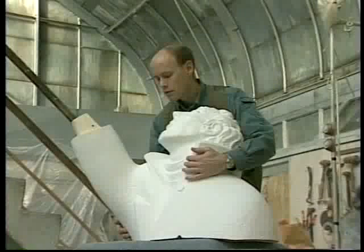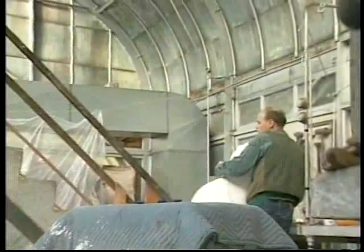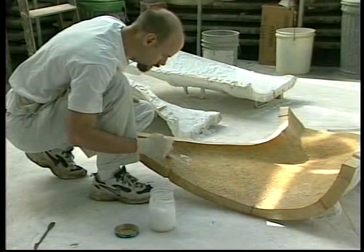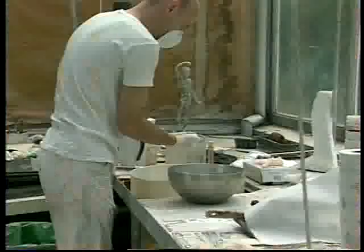The complete plaster model for a monumental scale sculpture is usually made in sections to facilitate fabrication of the model and the subsequent bronze casting. The practical method of casting the poet is to make the base, the right arm, and the head and shoulders as separate units. The upper and lower torsos of the figure are also made as separate units. To make these sections, the plaster piece molds are disassembled and prepared to accept the wet plaster of the model. Each mold is brushed with a parting agent made from stearic acid, mineral oil, and kerosene. This parting agent will help prevent the wet plaster from sticking to the piece mold.